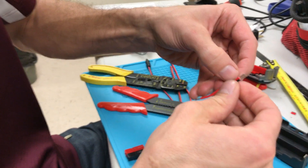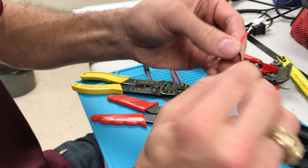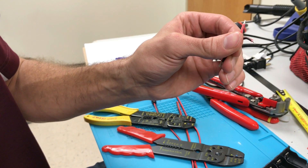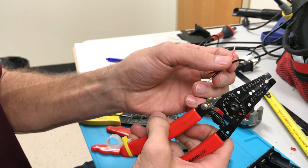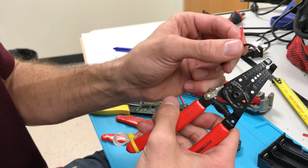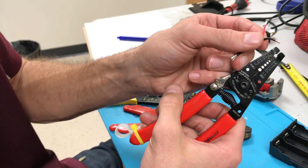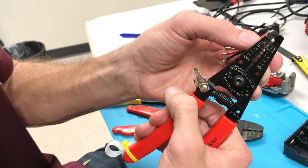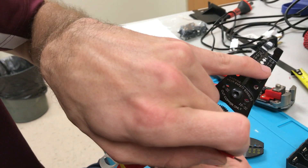Since we're crimping just one side, I'm going to separate these with my fingers and give a gentle twist so that the wires don't fray. Make sure that if you're using other kinds of strippers you use the proper gauge so you don't lose any conductor strands — you need every last conductor strand for the wire to hold the current carrying capacity it's rated for. In our case this is an 18 gauge wire, so this is your 18 gauge hole, which corresponds to about one millimeter.